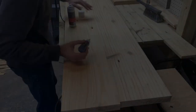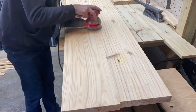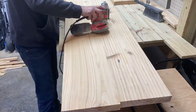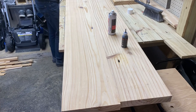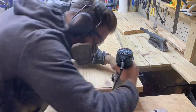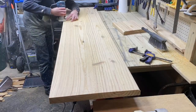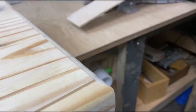I highly recommend investing in some kind of breathing or face mask protection when sanding. Next step is to fill the holes using CA glue with some accelerator — those little black dots are filling holes. It's not super necessary, a little OCD maybe, but I wanted it to look really good for the customer. It's all being painted so it won't be too visible anyway. I used the random orbit sander a bit more and then went around with the trim router to do a little round-over profile. I dropped the round-over bit a little bit lower so it gave that little lip, which I think made it look really nice. Flipped the board, clamped it to the workbench, hit the other side, and sanded everything smooth. Really happy with the way that profile turned out — makes it look a little more professional.